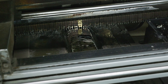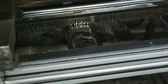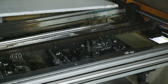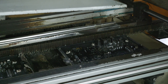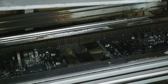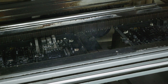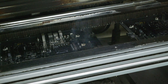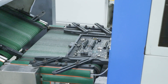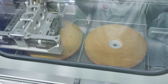This is my favorite part of the whole production line — wave soldering. This technique solders all of the through-hole components: it's a wave of molten solder and the motherboard runs along the surface of this molten solder, soldering the whole backside of the motherboard. It is really, really cool to see in action and it smells cool too. Once the wave soldering is complete, the board gets cleaned along cleaning wheels to remove any debris or anything left over from the wave soldering.